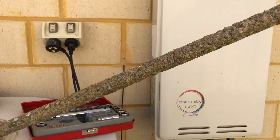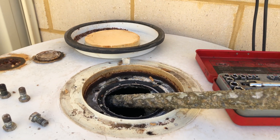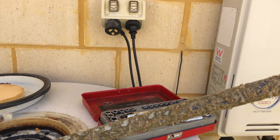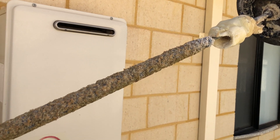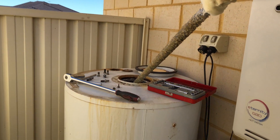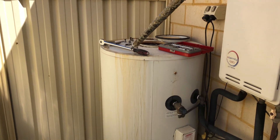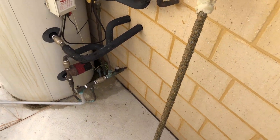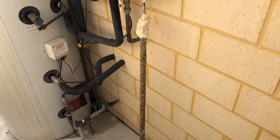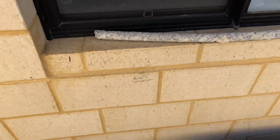I have changed it about five years ago. This is the one that's in there currently — there's still plenty of material on it. But as you can see, there's a lot of dissolved solids in the water in this area, which is no doubt a contributing factor. I must say that anode is massive; the one that was in there before was half the size.